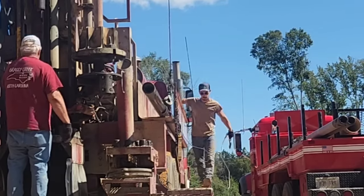All right, we are officially done under here. We've got our pipe coming in over there, 90-90 in through the tank T. We come up, we've got our PEX ball valve here, then we're gonna go through our regular sediment filter, and we got another ball valve, and then our PEX pipe runs all the way over there to the fresh water inlet for the house.